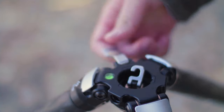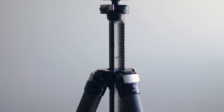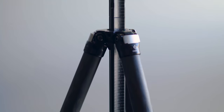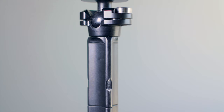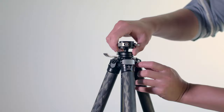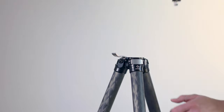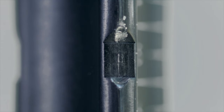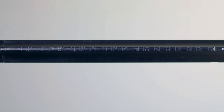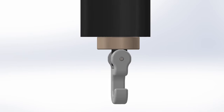We felt very confident in the design and were excited to release it to the public. At PhotoPlus, the tripod was getting a lot of use — the center column and safety stop must have been engaged hundreds or thousands of times. We started to notice one particular problem: the safety stop notches were deforming over many cycles, which was causing the column to lock up inside the apex. This was obviously not acceptable, and this one problem pushed our production back probably six months, because it cascaded into every single part of the tripod and we had to do an entire redesign.